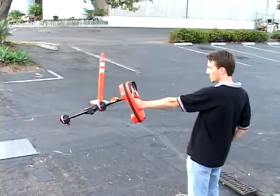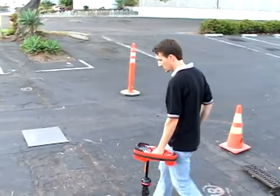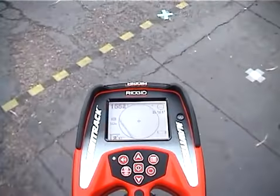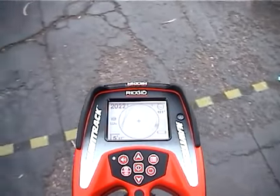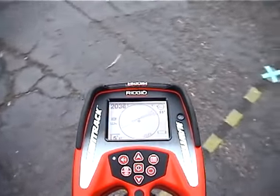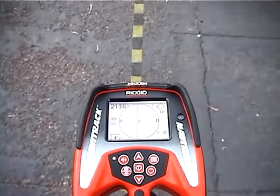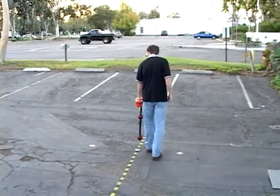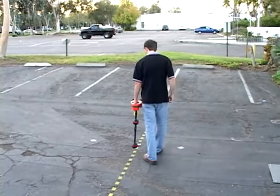We'll find the transmitter's direction just as we did before. But this time, rather than locating a pole first, we'll pick up the equator and follow it to the sonde. As we approach the sonde, the signal will increase. When we move past it, the signal will decrease, so we'll back up to where it's highest along the equator.